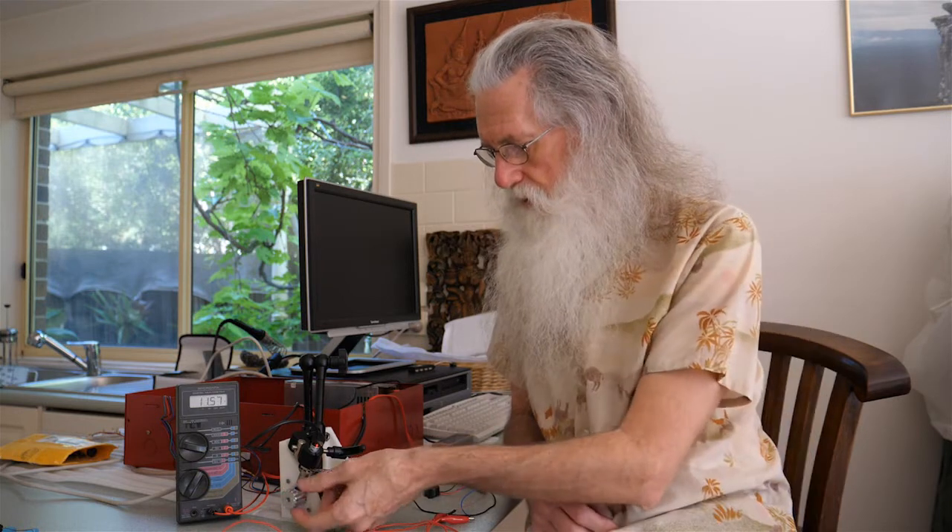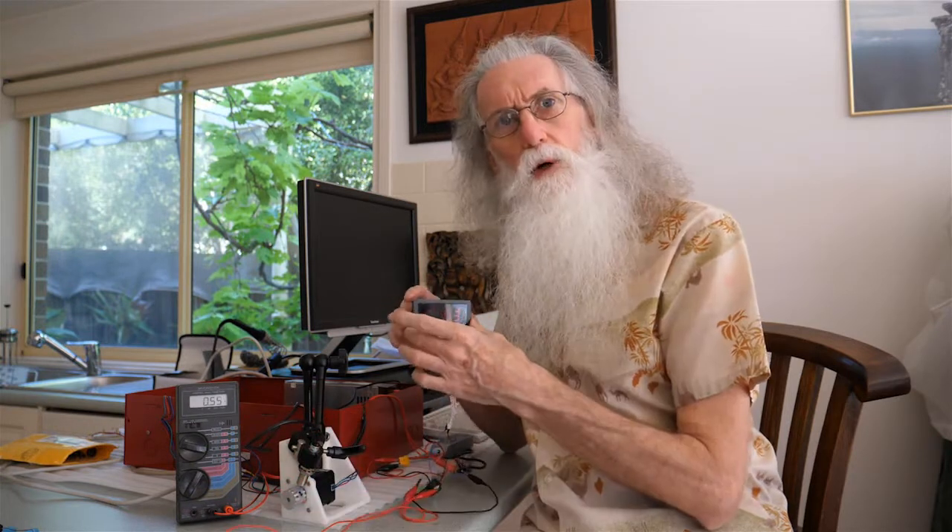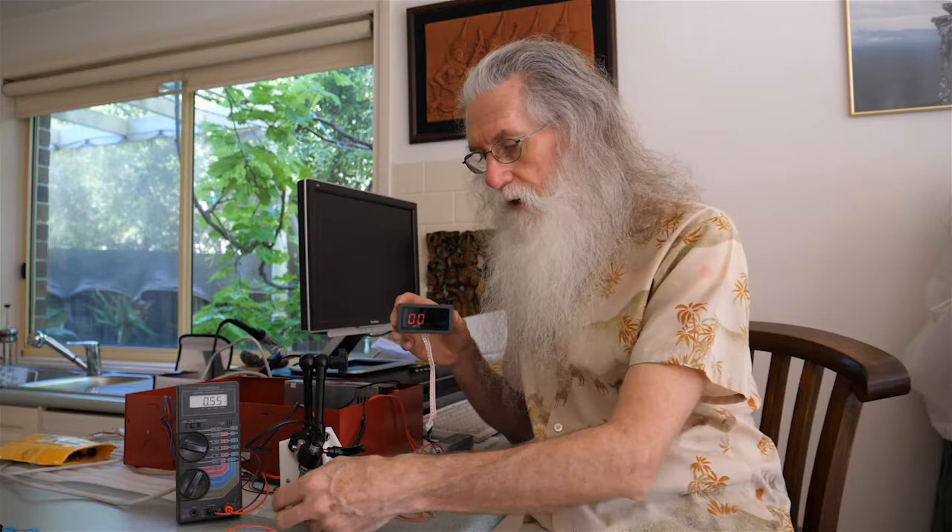I just went out and got another battery connected to the meter. So the meter is separate — no buzzer. You need to have a separate supply to the meter and a separate supply to the sensor. Even though on the back of the meter it has blue, black, and brown wires, do not connect those cables. Just connect the black signal cable to your meter and run the power separately and it should work fine. Where you have the meter you need to run three wires, and where you run your sensor you need to run three wires, then one of those wires joins up with the other. Working fine now — I'm happy with that.